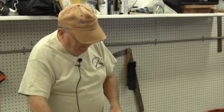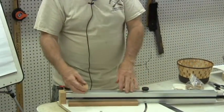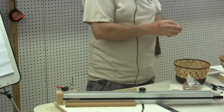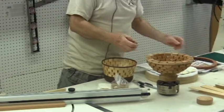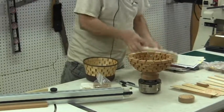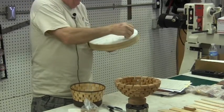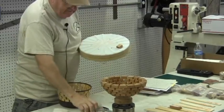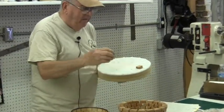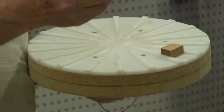So now that I have that, my pencil mark on top, I start out with the wood, go through and pop off a piece, then you turn it over and do the other side. When you go to put these together, which means placing them on this ring, which we're going to do with this, okay, then all I do is take these, I marked it with a pencil mark, okay, I want that face down, okay, and I'll just sit and put all these. By the way, in the meantime, if you got any little piece of wood there, you just take and scratch it on the sandpaper to knock off any pieces like that.